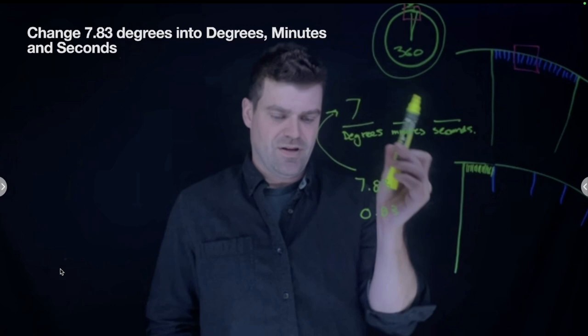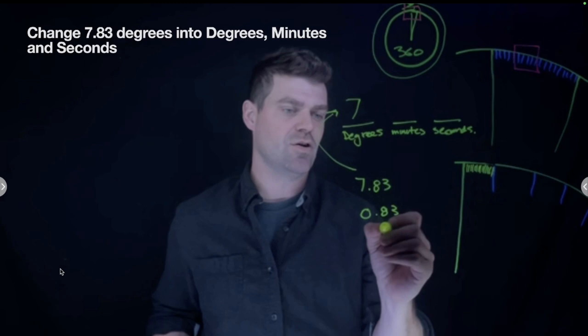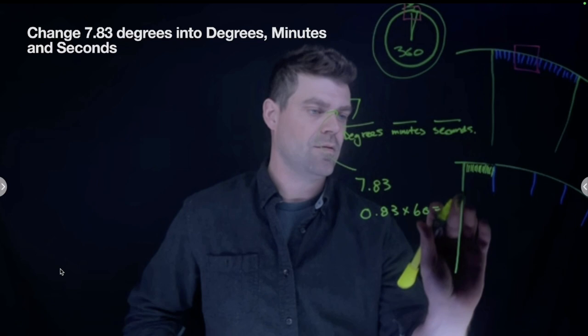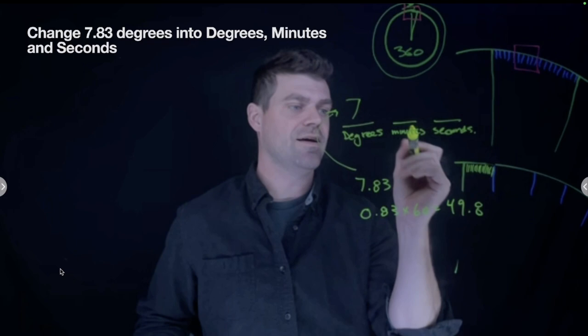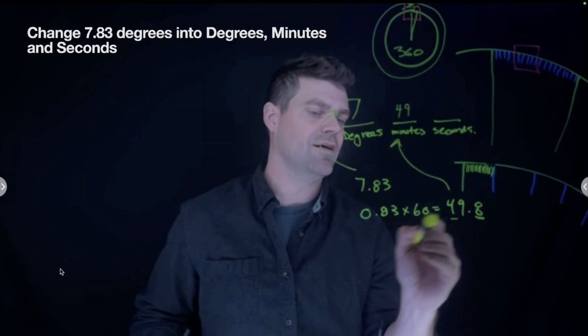So we have to figure out how many minutes of a degree 0.83 is. To do that, we just take 0.83 and times it by 60, and that tells us how many minutes we have left. 60 times 0.83 is 49.8. So after our seventh degree, we have 49 minutes left. We plug our 49 in there, and what we have left is 0.8 minutes.